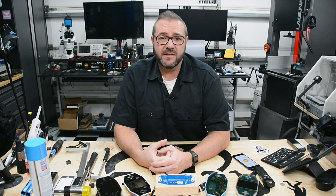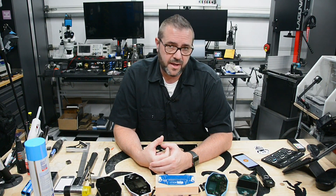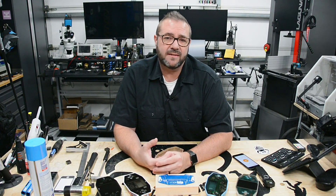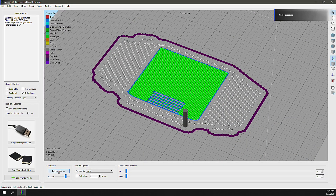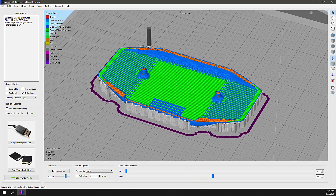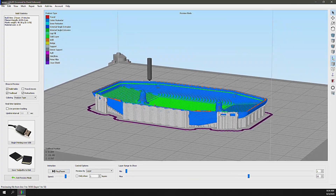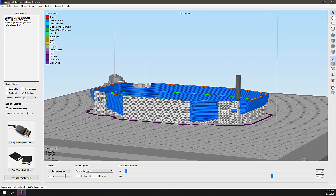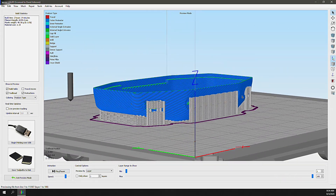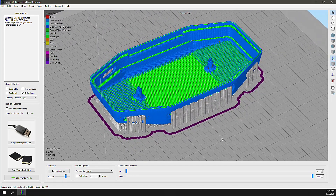For prototyping, the main processes are SLA or FDM printing, laser, or CNC milling. The main concerns are tolerances and undercuts. Resin and FDM require undercut supports which impact surface quality and finish. Object design and print orientation can minimize or hide blemishes and save a lot of post-processing time. Resin and FDM are additive, so there is no concept of changing the work holding strategy mid-print.